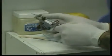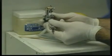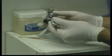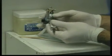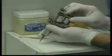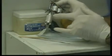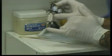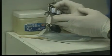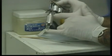What you're going to do is loosen this again and just slide that tube up until that needle just protrudes through the bottom of the tube. And it's about maybe the thickness of a couple sheets of paper is all that needle is going to stick out of that tube. And I'm going to push on the armature bar up here and force the needle to come out so you can see about how far it's coming out. You can barely see it. If you touch the end of this tube and wrap your finger across it, that needle would be barely coming out. And then when you push down on the bar, that's about how far you're coming out. I'll put this up against the glove, maybe you can see. So that's what the needle looks like.